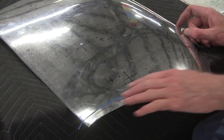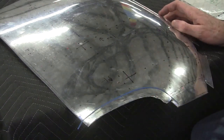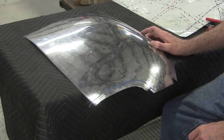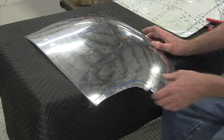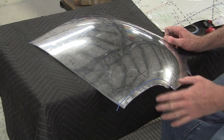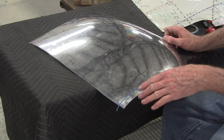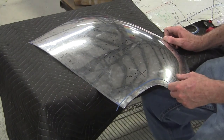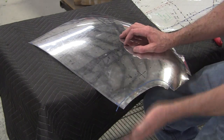That's an offset, or what we call a joggle, and it's about almost a quarter of an inch — probably about 200 thousandths. This can be approached in a bunch of different ways. The English often use what's called swaging machines, which are little screw presses — they'll make a little die and put that in. A lot of Americans and people all over the world now use pull maxes — they'll make a die and put this in the pull max and it'll make that nice little jog all in one go, but you've got to make the dies up. On a real budget you can use a pair of vice grips and bend it down. I'm going to tip it on the tipping wheel — same as doing it with the vice grips, but the tipping wheel is rolling it in versus going in at one notch at a time. It needs to go down 90 degrees.